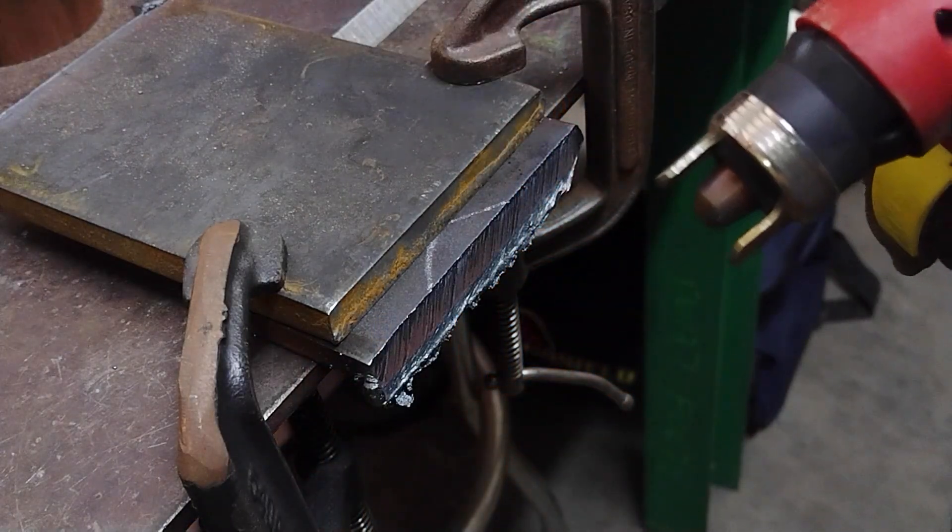This drag tip really does come in handy. I'm going to make a brass cut again just because I love the fact that I can cut brass here at the house. I'm not a fan of the smell, so wear a respirator — I highly recommend it any time you're cutting brass or anything with high zinc content, otherwise you might get zinc poisoning and it sucks. I'm going to cut some more brass; it's going to be almost a quarter inch thick. I'll keep the same settings I used on the half-inch steel and see how it cuts.